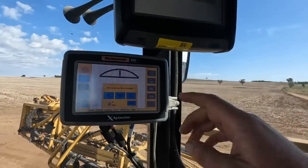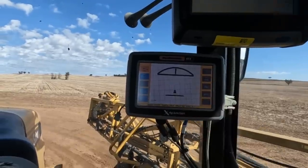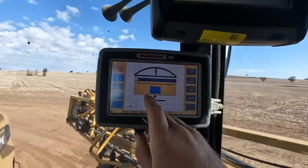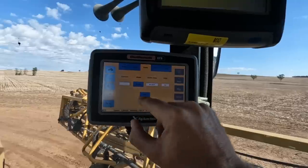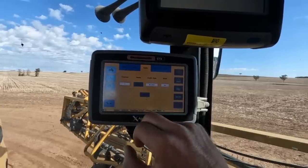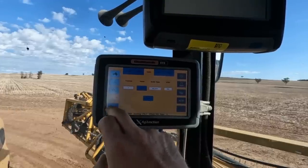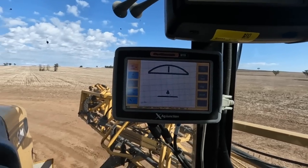Well, we made it, which, yeah, it was a pretty good time actually. It might only be a little bit under an hour, I think. But one thing I got to do is swap over, and I'm not sure exactly on this screen how to do that, but I've got to swap over to Radio Link 2, which is for the base station that's here at the development block. So I'll try and go into settings, radio, oh, there we go. Should be as easy as that. If I hit 2, apply, save. And wait, that should go to 3D, it should go to RTK in just a moment.